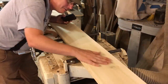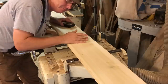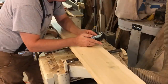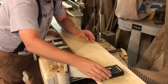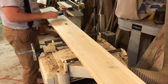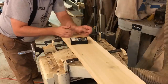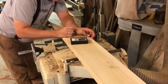Now I've got one side of the board nice and smooth. Taking a reading on the freshly planed surface: 12, 13, 12, 12, 13, 13. So my 10% reading is gone — I don't have a 10 anymore. That's a little more accurate because I've taken that first layer off so the meter can penetrate a little deeper into the board. The reading consistently shows 12 to 13 percent.